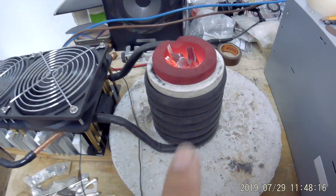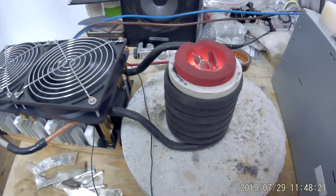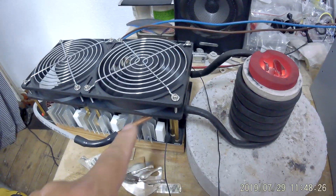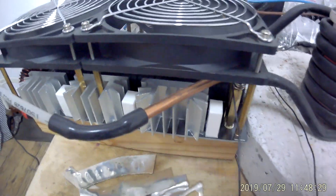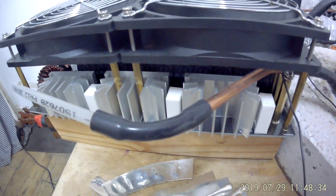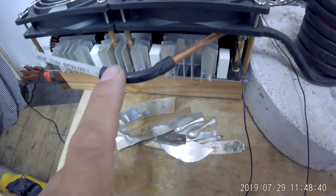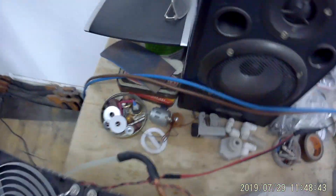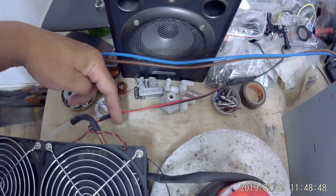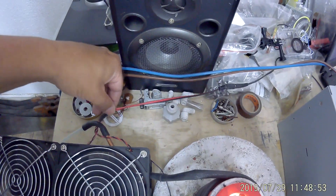That's with too many coils — the less coils you use the better it is. We've also changed out the copper tube from 3/16" up to a quarter inch, which is a lot thicker. We've bypassed the electrics by bending the copper pipes outwards, and put some flexi neoprene rubber tubes on to keep it well away from the tank itself. Just want to make sure that doesn't touch there.